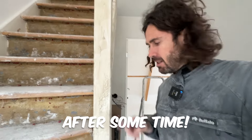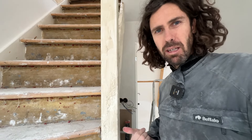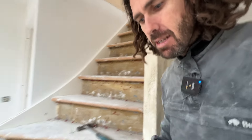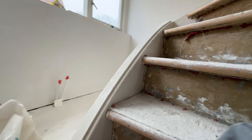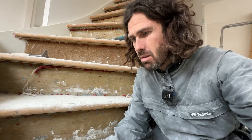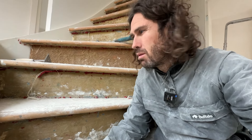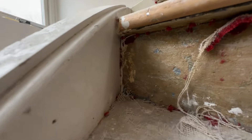You can see now it's starting to work. The chemical process is peeling the paint off the wood, but you've got to leave it for a while to let it dry. I realized I've still got this side of the stairs to do, they're pretty crusty as well. I'm not sure if I'll just sand them or I should put more chemical process on there. While there's no carpet on here, I think it might be easy just to do the chemical process and that'll get a smoother finish in the end. Because if I paint over the top of this, you can see it's pretty crusty, there's lots of chunks in there because I think it's been painted over several layers.